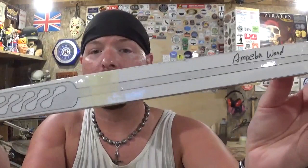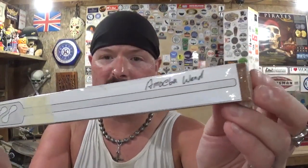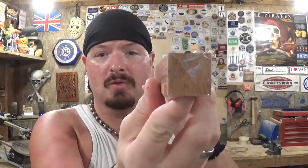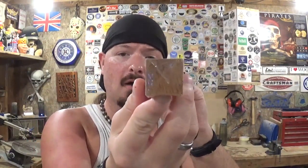It has some interior cuts in the handle, so I think it's going to make a great characteristic for it. This is scroll saw compound work, and what you want to do is make sure your blank is a perfect 90 degrees all the way around. These are around one-inch square strips and they can be made out of all types of exotic woods to give it a nice look. Right now we're going to head over to the drill press, drill all the pilot holes needed, and then head over to the scroll saw and start scrolling.